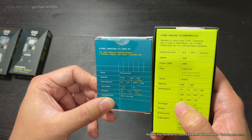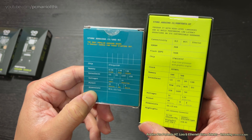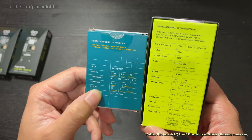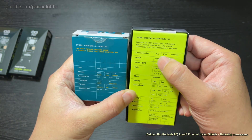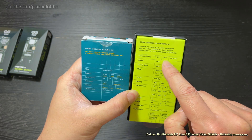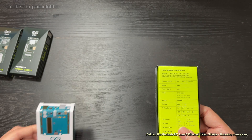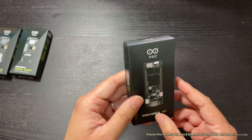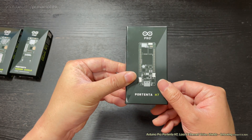And 1 megabyte SRAM — that is absolutely huge and incredible. That in itself is a huge difference. And of course connectivity is quite important, because we've got BLE — the new standard of Bluetooth — as well as Wi-Fi and Ethernet, which the Arduino Uno R3 does not have. For a professional level board that is quite normal.